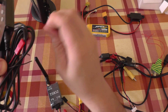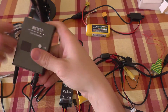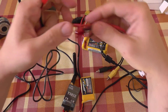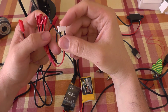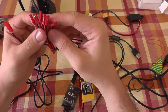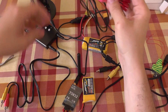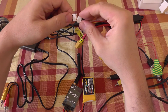I'm going to power the receiver from the same battery. This is a cable made for small quads that plugs into the main LiPo battery balancing plug and has multiple outputs to power small loads like LEDs. It's also useful here since the receiver does not need a lot of power, so this plug will be more than fine. I'm going to plug in the receiver.